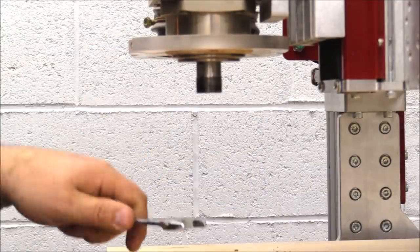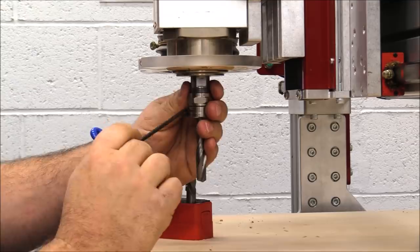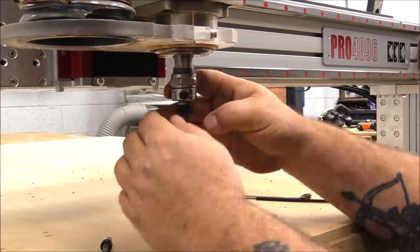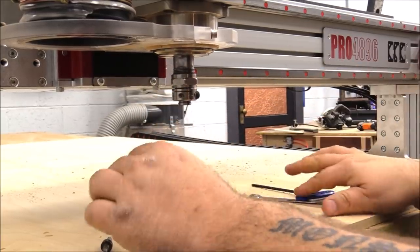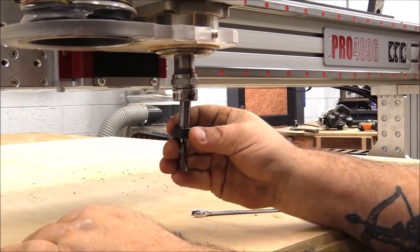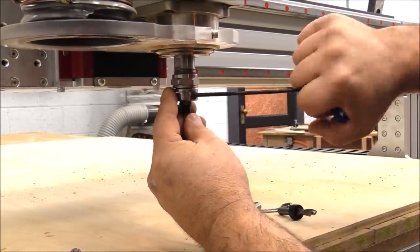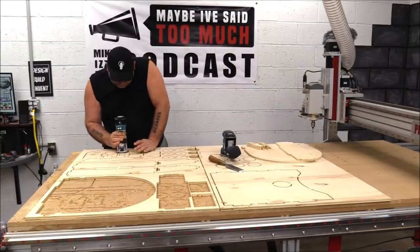This is another great product — it's called the Muscle Chuck. It's a quick-change system you can put on any full-size router, one and a quarter horsepower or bigger, or on a CNC machine. It makes changing router bits super fast. Instead of two wrenches and traditional collets, I just use one Allen wrench to loosen a screw and pull out the bit. Through the use of collets, I can go from an eighth inch to a half inch to a quarter inch to a three-eighths bit very quickly. I can also put stop collars on it, so if I'm running a program with three bits I can set them all to Z-zero and just throw in the new bit and hit go. I'll put a link in the description below.